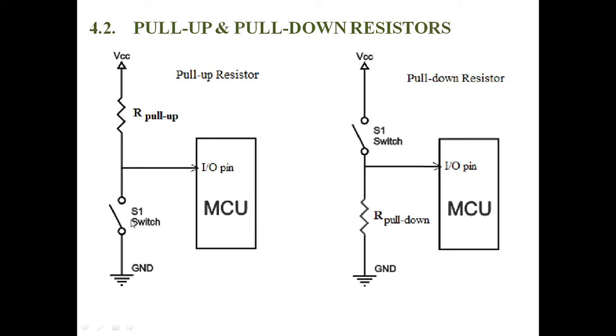If the switch is closed, the VCC voltage comes to ground. When the switch is open, the VCC voltage comes to the input pin through the pull-up resistor. These input values may be logic high, logic 0, or when pull-up or pull-down resistors are not connected, these values are in a high impedance state.